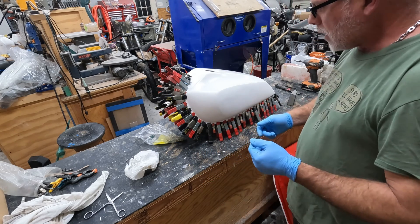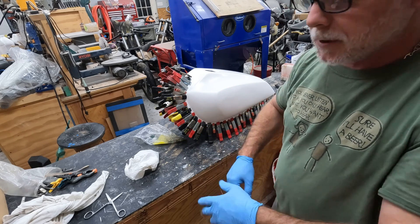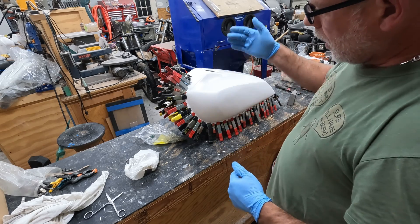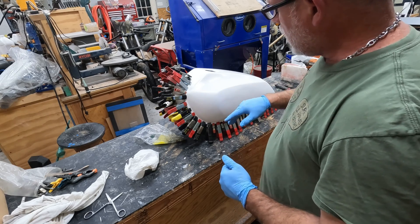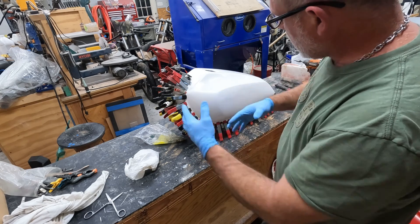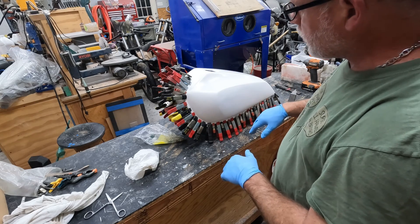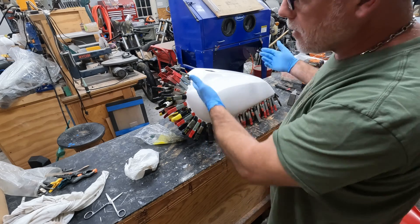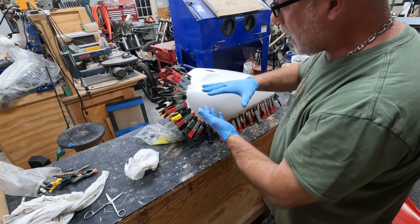The cup the material was mixed in still has a little residual left. I'll monitor that cup, and when it starts to kick I'll come in and remove the clamps from the tank while it's still somewhat green, so I can dissolve any extra putty that got on the tank. With a tank, you line up center lines to center lines and the part is basically centered from the top and the bottom.